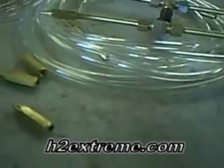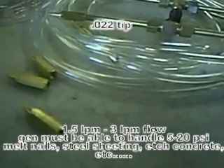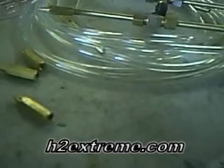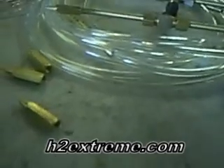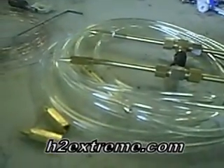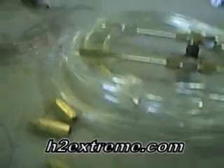Another size tip we have is the 022 tip, which is good for a flow anywhere between one and a half liters to three liters a minute. I have worked it up past five liters a minute, but I recommend the next size up for that. With the 022, you're looking at melting quarter-inch thick material.